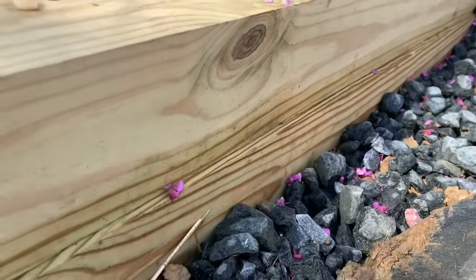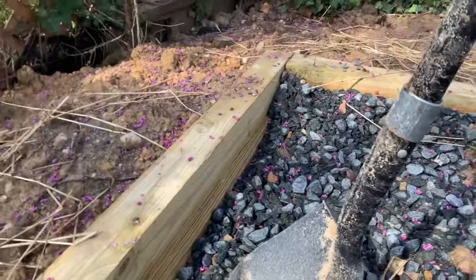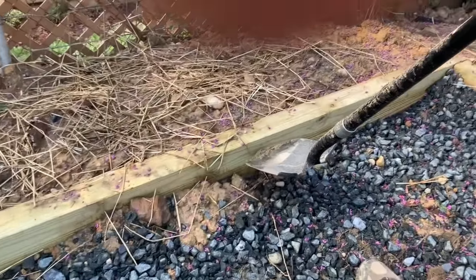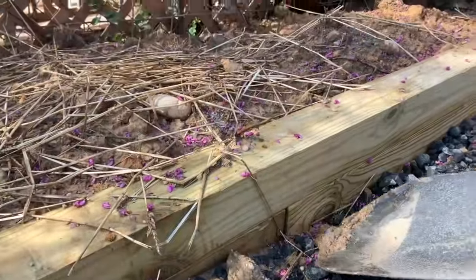That's very standard, and basically the design rule was that I didn't want to have two 4x4s end at the same point, so I used this shorter piece of 4x4, so that the joint lands at the midpoint of this upper 4x4.